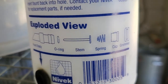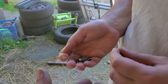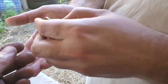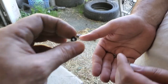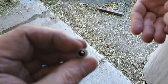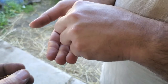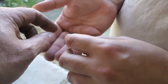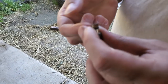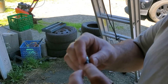You've got to watch this because your animals get really frustrated. That's the Nivac bottle — the nipples are pretty common. Let me see the cap: the cap has a hole through it, and that hole has to be clear. The spring has to be clean. The o-ring is down inside. So we go: stem first — the o-ring is already in the hole — small diameter goes down so it points, then the cap. You can feel it has good response, feels crisp going down and back up.